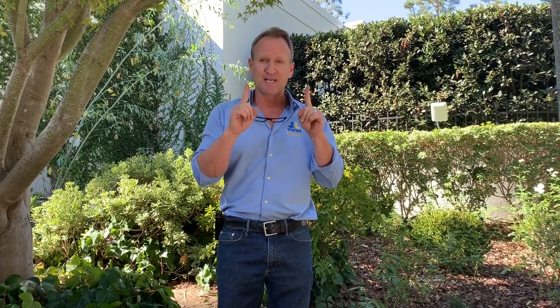If it's not your toilets, landscaping, or swimming pool, you're going to have to hire a leak detection expert. In this particular situation, several plumbers and leak detection experts have already come to this property and walked away — it's been a needle in a haystack. There's an underground leak somewhere on this hillside and the piping is PVC, so the equipment nowadays cannot pinpoint it unless you can trace out all the pipes. A complicated underground leak detection requires plumbing skill combined with leak detection equipment, and that's what Twin Home Experts is really good at.